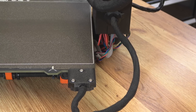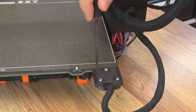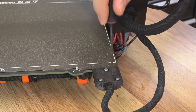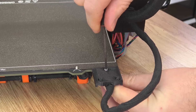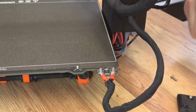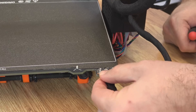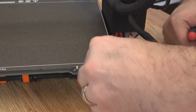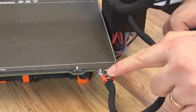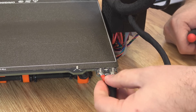On the final versions of the 2.5 you're going to have a cover that looks like this for the connectors on your heat bed. This is a 52 bed, it is 12 volt — not like the Mark 3 which is 24 — but it does have a removable sheet, so it's a lot like the Mark 3. We'll remove this, and there's a nylock nut on the bottom that holds this printed part on. Now is a great time to check your wires and make sure there's nothing wrong. You don't want these moving at all. The biggest issue I see on these printers is these wires get loose and burn up one of the terminals on the main board. Double, triple check this and the thermistor — make sure there's no issues there.